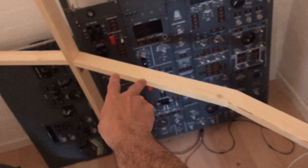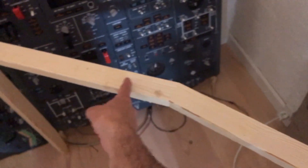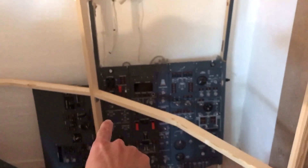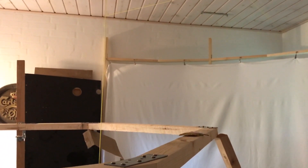The frame itself is made out of wood. These sections — two pieces of wood — are each cut at seven and a half degrees and put together. That's 15 degrees for this one: seven and a half plus seven and a half. 15 and 15 makes 30 degrees for a section, and for each 30 degrees I have vertical supports. So that means from the middle I have one, two, three — 90 degrees to each side.